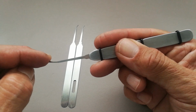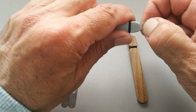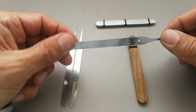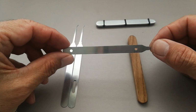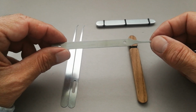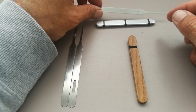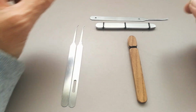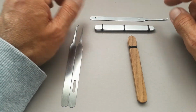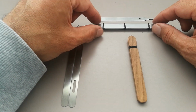This works perfectly well. The thing I don't like about it is that to get these picks to move in and out freely, you have to sand the tangs on these picks up to about 2000 grit to get them nice and slick, so they'll slide in and out of those aluminium scales freely. Otherwise it's a mission pulling them in and out, because the aluminium's a soft metal. If I'd done them in stainless it probably would be different, but I didn't have stainless available to me that I thought was suitable for making a handle.